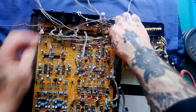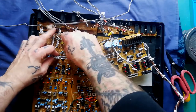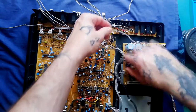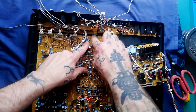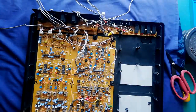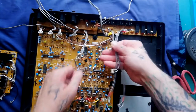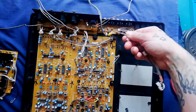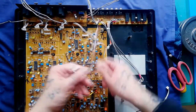This leaves two cables still attached, passing under a cable tie and terminating on the record playback circuit. There's a group of three — the topmost of these three is going to the socket in the upper right of the record playback board, just below the mounting post. That board is now separate. It allows us to see that these four cables coming from the board labelled as the out input jack were connecting to the mixer board; the various cable lengths and pin numbers will help you to reassemble that correctly. The only remaining plug not yet disconnected is the longest one, running from this board over to the record playback amp.